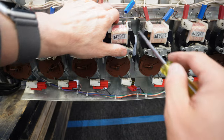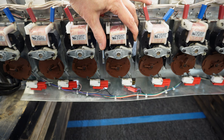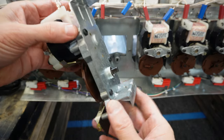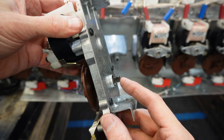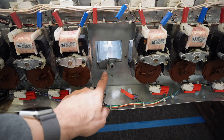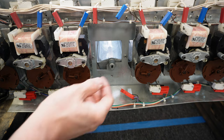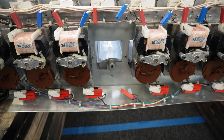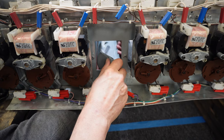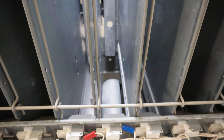Go ahead and remove the screws, starting with the top ones. Now I've got the motor — I'm holding it in place — and I'll just pull it and it disconnects. That's the connection point where the cradle mounts to the actual motor. Once the motor is removed, you've got a big square opening to get your cradle through. Rotate the cradle until it matches that shape, then pull it straight out — it's much like taking a round peg through a square hole. Grab the bottom of the cradle, turn it so it lines up, lift up, and the cradle slides right out.